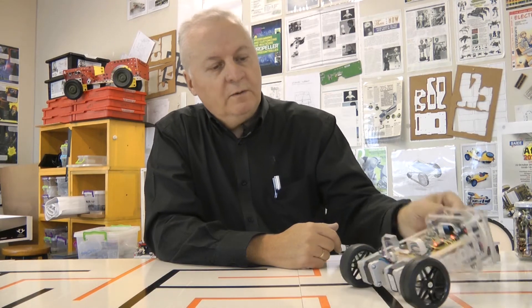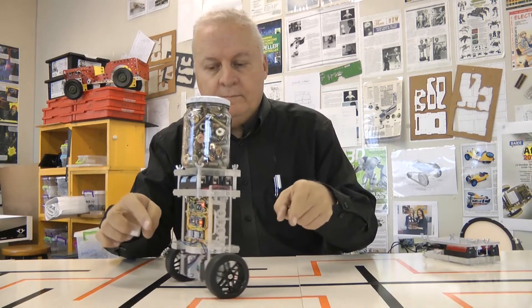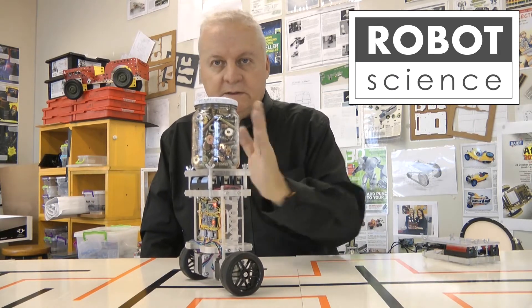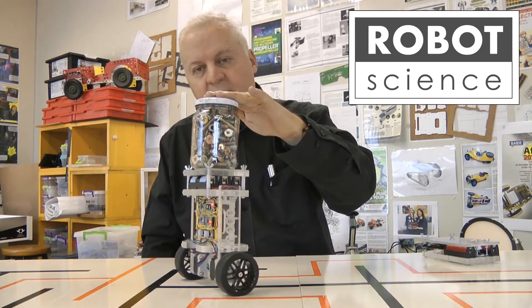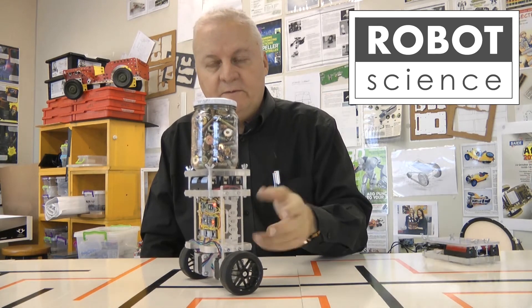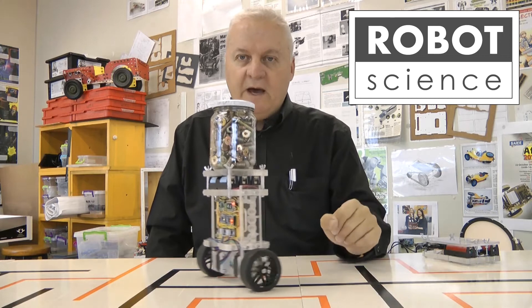Let's switch it back on and let it power up — and it's operating again. This movement gets into a bit of a swaying motion because we've got quite a high center of gravity on quite a big mass up here. We would need to go into the programming and actually change the PID maths formula slightly to compensate for this bigger mass.